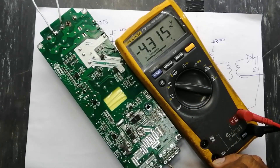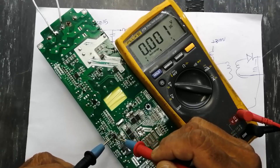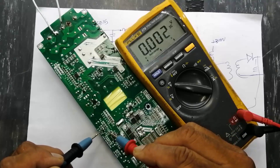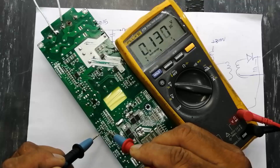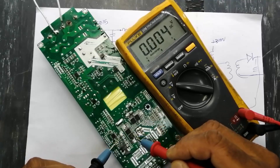Wonderful — it has 4.3 volt output and this power supply is good. Here is the feedback network: an operational amplifier and voltage comparator which checks and monitors the output. Here is the TL431, with reference voltages of 2.4 volt and 2.49–2.5 volt ground reference.